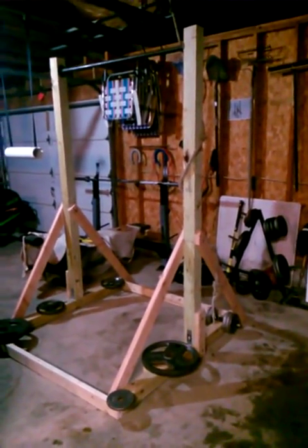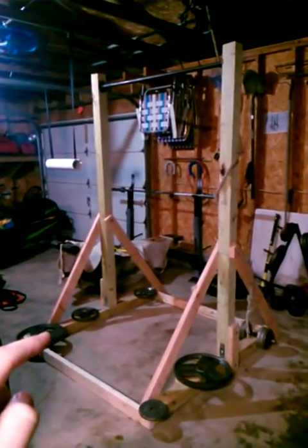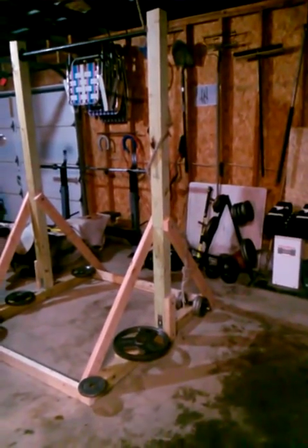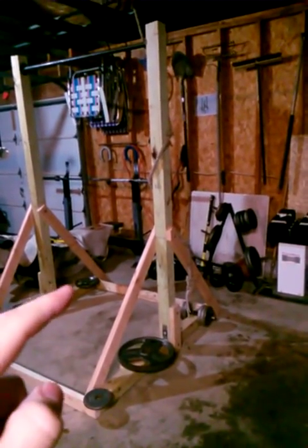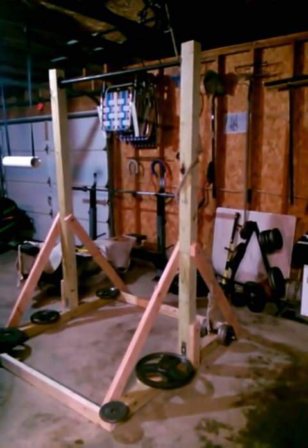To secure the entire station, I used carriage bolts — two 10-inch and four 8-inch — and then two more 8-inchers down here as well. There's another two-by-four down here for racking and bracing, and I had metal angles on the four-by-fours down here — they're four-inch by four-inch. I used wood screws to help secure it since I was doing this by myself.